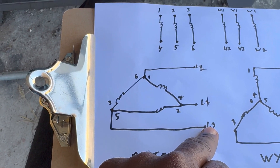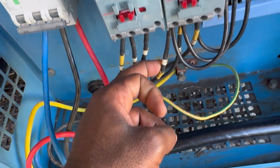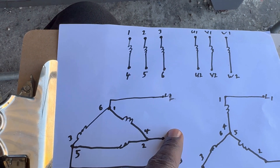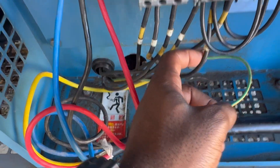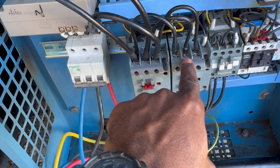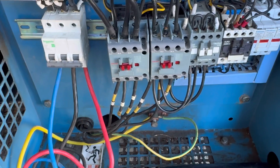Running back through it quickly: line one has terminals 2 and 4; terminals 6 and 1 are connected to line two via the jumper; and I jump 1 to 1, 2 to 2, and 3 to 3. That is my delta circuit. Now let me move to the star circuit.